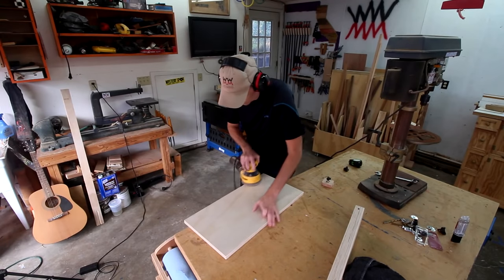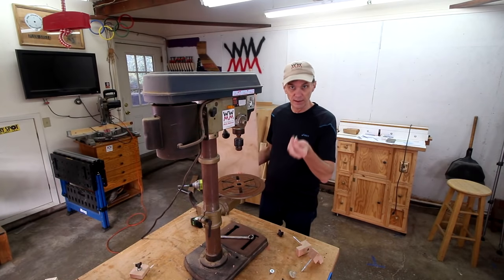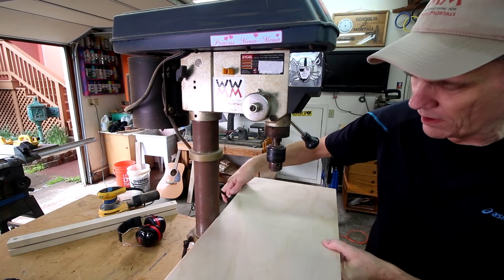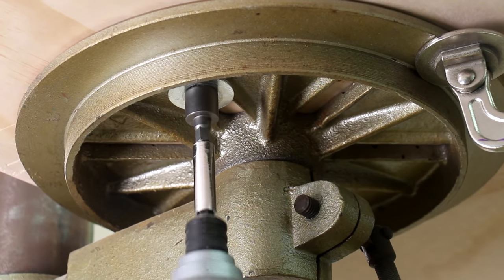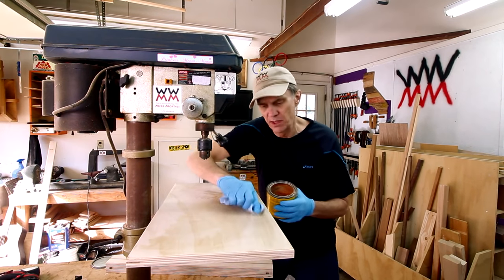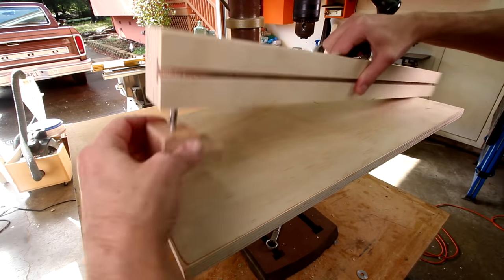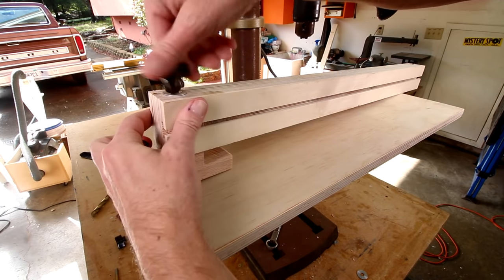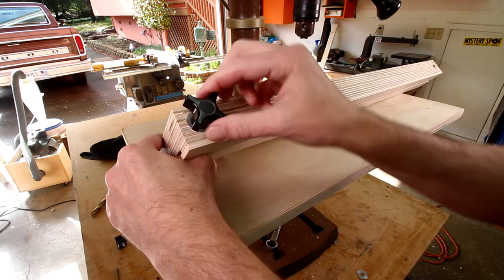The table itself is just a board — I'm easing over the edges so they're not so sharp. I'll screw the top in place using lag screws. I need to be careful how I position this table; if I put it all the way to the post there won't be enough room to crank the handle. Applying some paste wax will help the fence slide a little easier and provide some protection for the top. These clamp blocks will slide into that hole, then I'll add a washer and attach it with one of these star knobs — most hardware stores sell these or you can buy them online.